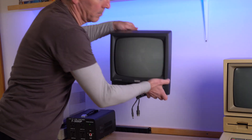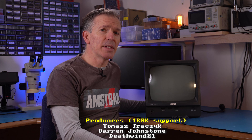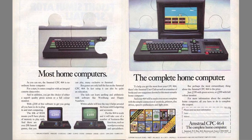So let's take it to the lab and have a look at it there. For those not familiar with the Amstrad CPC, it may sound odd to talk about a monitor generating a power supply used by external devices — in this case, the computer. But that's the way Amstrad designed them on purpose, because every Amstrad CPC came bundled with a monitor, whether it was the green monitor, the monochrome monitor like this one, or a color monitor.